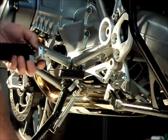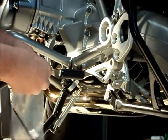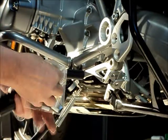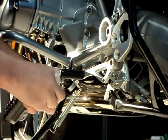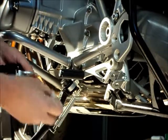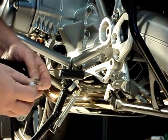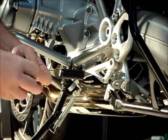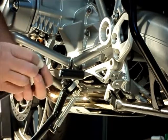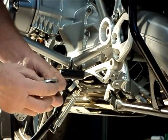Next we're going to get the big gripper peg ready for installation. In our parts kit we have a white plastic dowel pin. We're going to use that to secure the spring into place while we're assembling this. The spring goes in with the bent end pointing towards the bottom. We're going to put the dowel pin through the clevis and through the spring in order to hold the spring into position.